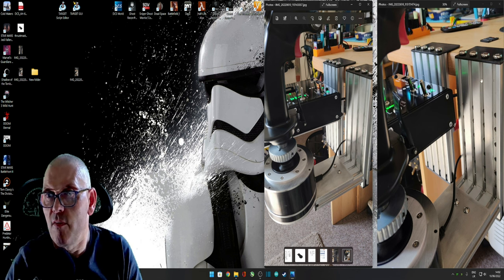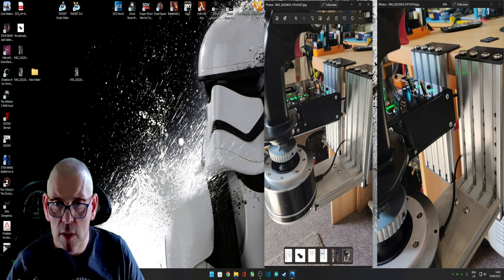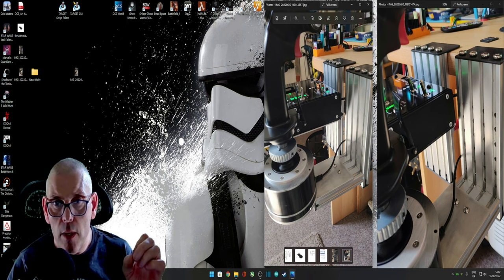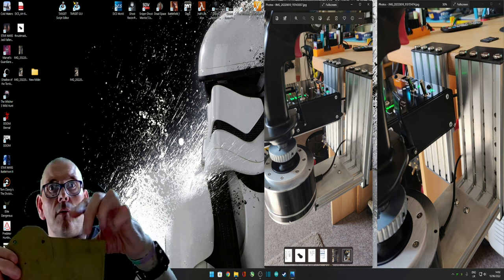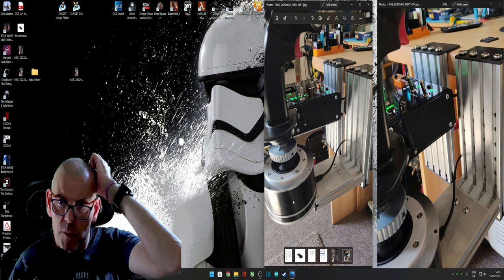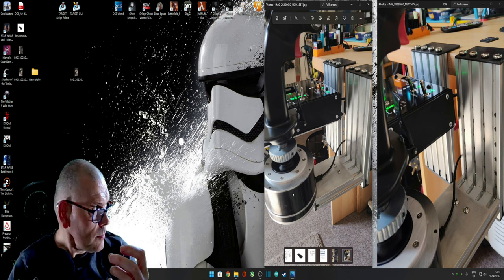And for this part, as you can see here, it actually comes along and then goes around. I got that nice and smooth, not that it makes any difference, it just looks nicer. I've got a turntable, so I actually bolted the center. If you notice, that's the cardboard I used to get the template. There's a tiny little hole in the middle. So I laid that over the aluminium, drew around it, put a mark on the center, drilled through the aluminium plate so I had a center hole, and then I bolted around like a plug on the bottom. Just bolted it through.